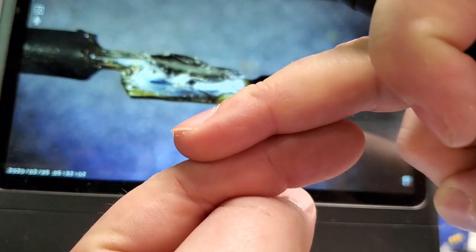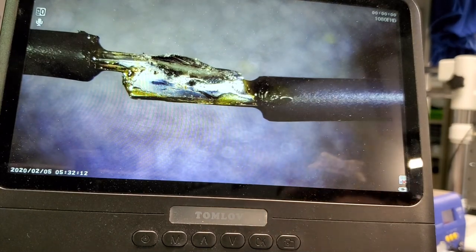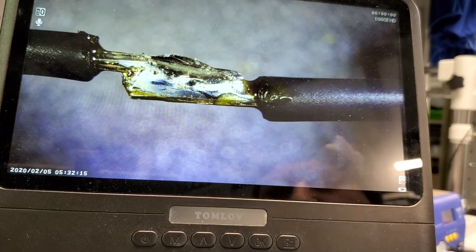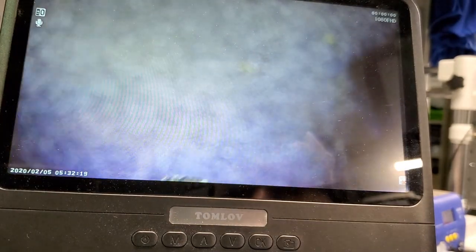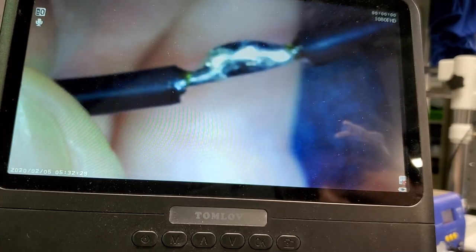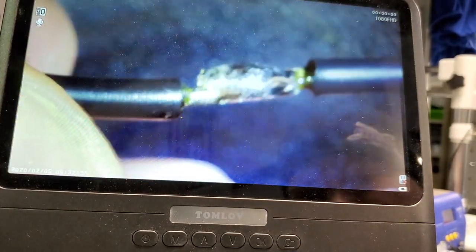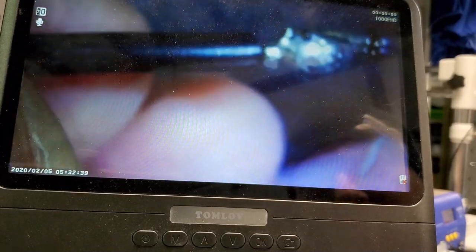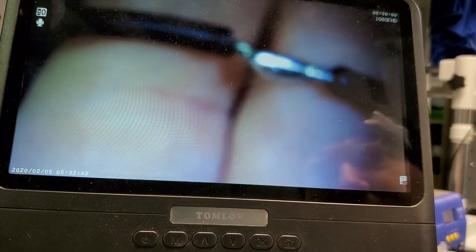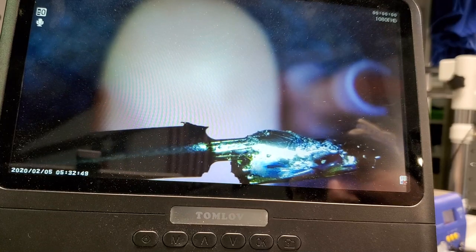You want to place the wires parallel to each other after they're tinned, and then the glob of solder from one will start to melt the other and the wires will kind of come together. This right here is as good as that gets. You always want to inspect your joints after soldering to make sure you don't have any cold solder joints, or on the underside it could be not soldered. There is a bit of extra solder on this joint because those globs were kind of big — I can touch that up with a soldering iron to remove some of that.